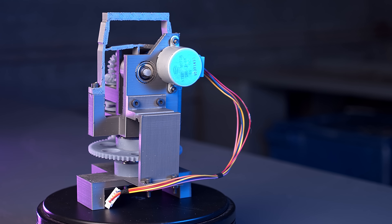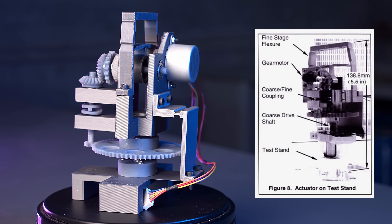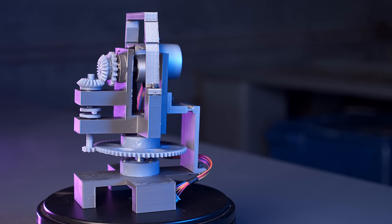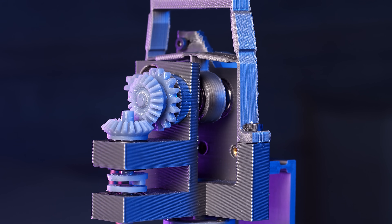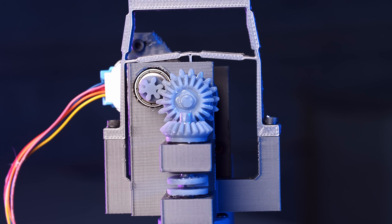The actuators are about 150 millimeters. Mine's actually a little bit bigger because the bearings that I have are too big, so it kind of forced everything to be a bit larger than it should. But otherwise, it's pretty close to what's on the JWST. The gear reductions are very similar, if not identical, depending on the stage.